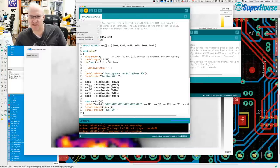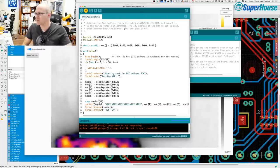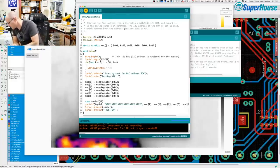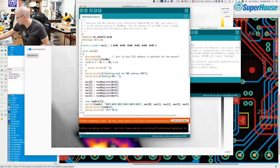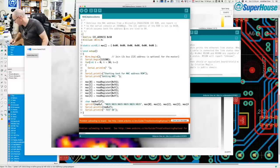I'm just checking my settings on here. So I've got it set as an UNO, I've got the serial port selected, etc. I have a feeling that I may have pulled this processor off some donor board that may not have even had a 16U2 as its USB to serial converter. So I may just need to reflash the bootloader onto it so that it will talk properly to the 16U2. But this is kind of getting into fiddly territory.